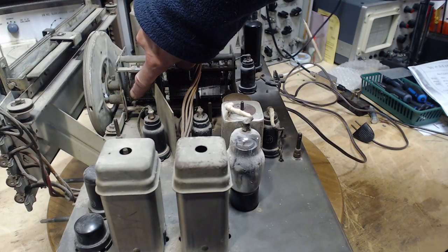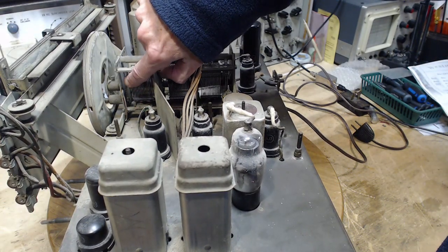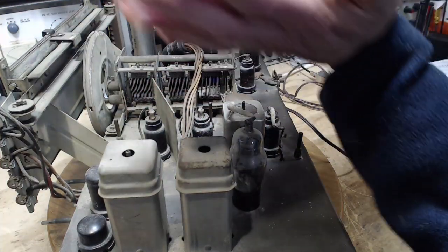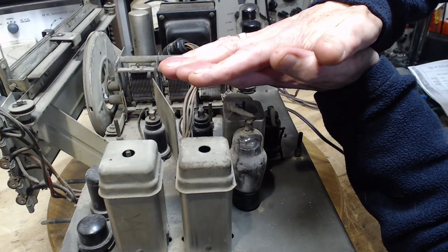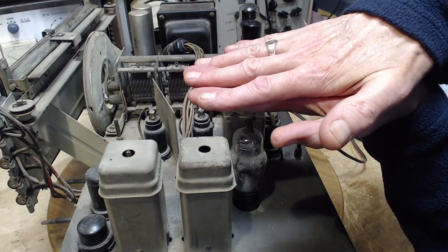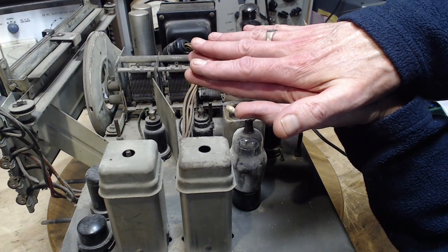See the gear driven tuning, and there looks like there's, yeah, this is the anti-backlash system, where it looks like I'm pointing at one large gear there, but that's actually two identical gears pushed together like this. And then there's a spring pushing one this way. And so when it engages with the other gear, the drive gear pushes against the spring and separates these back to make space for its gears to go in. And in this way, this gear is pinching the other gear all the time. It's grabbing on those.